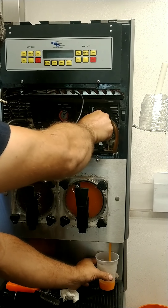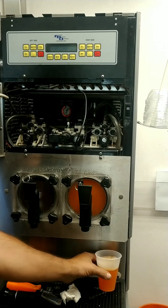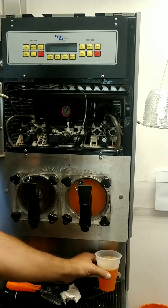To access the mixing valves where we're going to be making the adjustment, you loosen these two screws up on the bottom and take the two screws out on the top. You also want to slide this grommet over to the side, and then the panel just comes right up off the two bottom screws. That gives you access to your mixing valve.